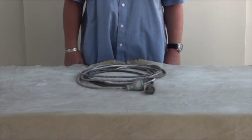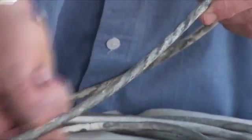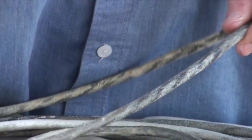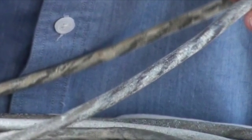Here is an example of a lead that is pulling too many amps. This situation comes about when you have lent your lead to a friend and the friend has tried to run an appliance that calls for more current. The end result is that the inner cables are heated up to the extent that they become warped.